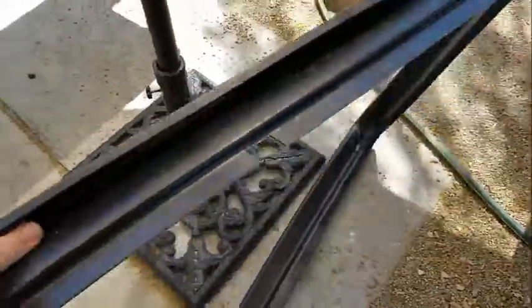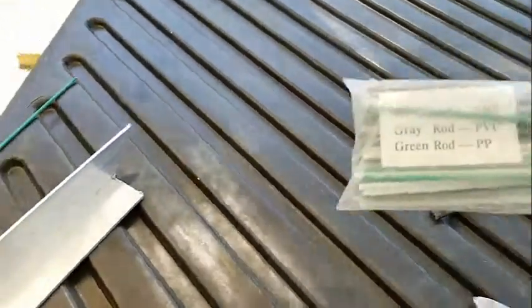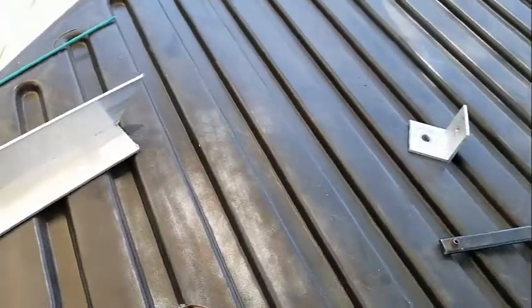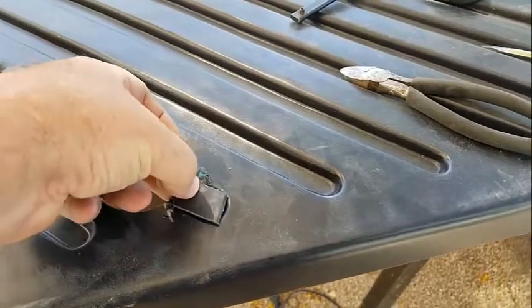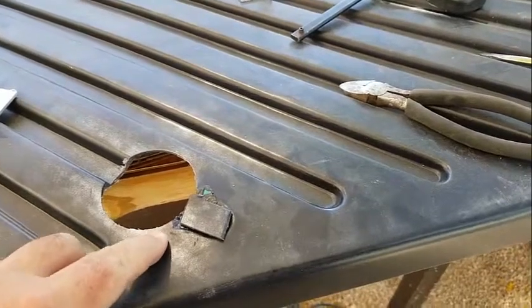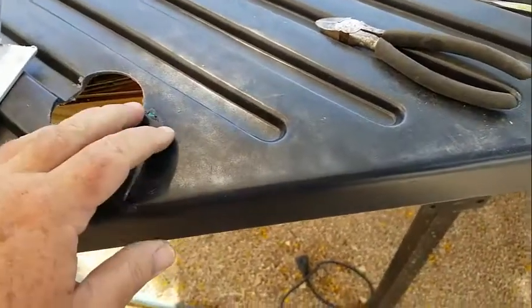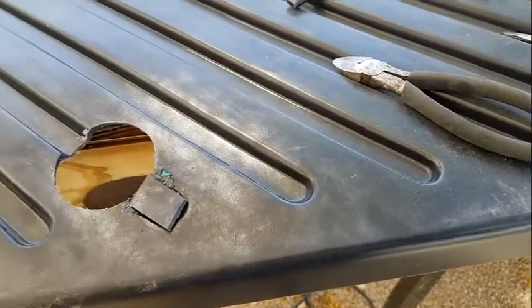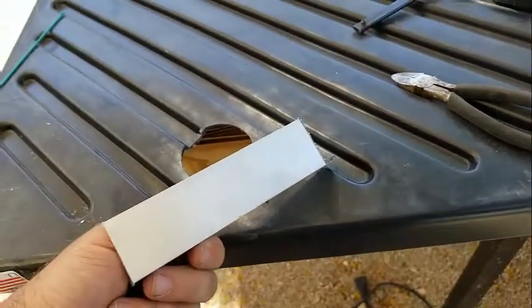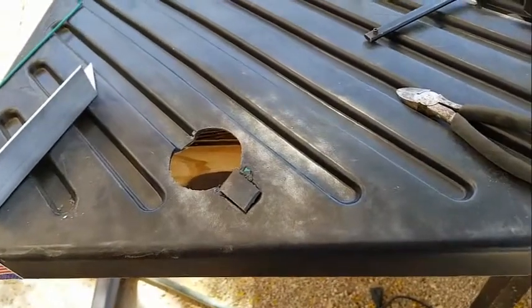I have the lip that I sawed off — I took a little piece out of this lip. I know it's polyethylene or something like that. I have these welding sticks which I thought I could use, but I don't have polyethylene. So I took that little piece and I'm going to fill that in at the bottom. Basically I'm trying to create a flat lip here. So I'm going to weld this in, melt it in there nice. Then I'm going to take a piece of aluminum as a heat sink once I have it pretty much melted, and flip the pan and do the other side. This piece of aluminum will keep the plastic from sliding as I melt it, and then it should create a nice flat surface.